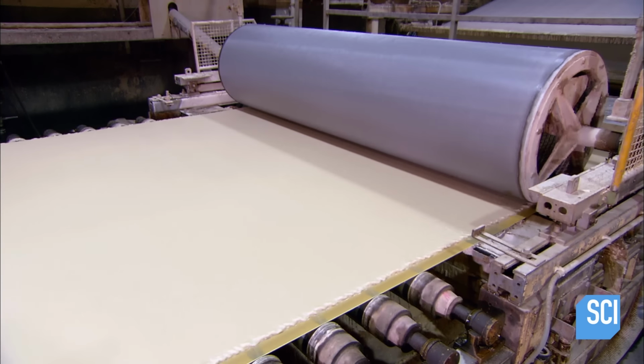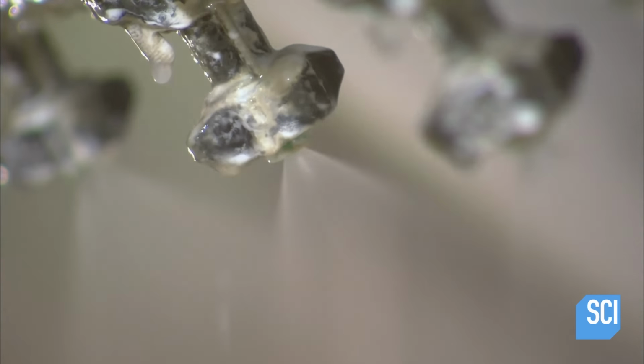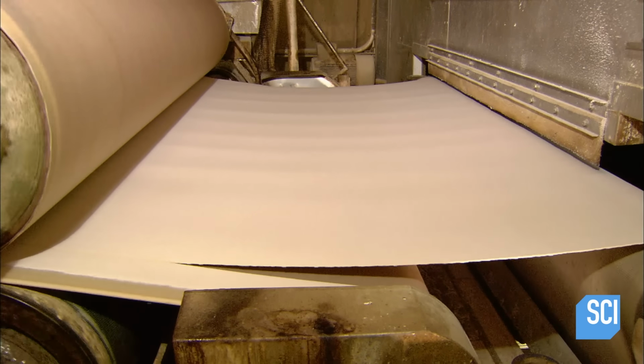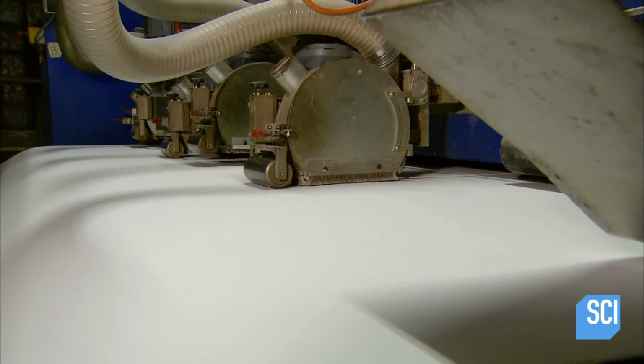They spray the pulp onto a mesh that drains water from it. The fibrous wood core goes between the layers of the lighter pulp. Spigots apply a mix of wheat starch and water that acts as a glue between the layers. Off the mesh conveyors now, the pulp board travels between cylinders that squeeze out the moisture. More heated cylinders dry it.